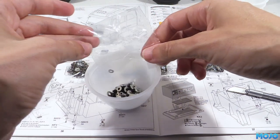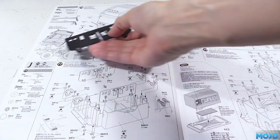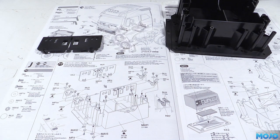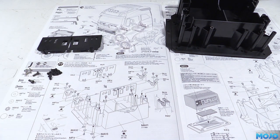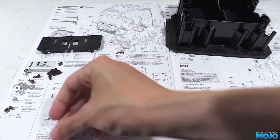Step 77: the center storage box. We're going to need KK3 the shelf, JJ2 the box, four HH7 hinges, then for screws we have four M2x4s, eight M3x6s with a low profile head, two 3x8 self-tappers, eight large three millimeter washers, four two millimeter washers, two M3 plain nuts and a magnet. Don't forget to keep the magnet away from the stash of screws.